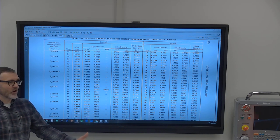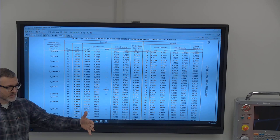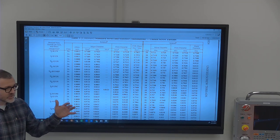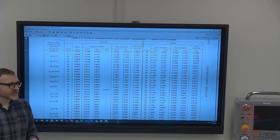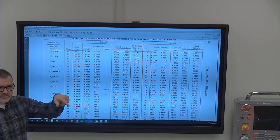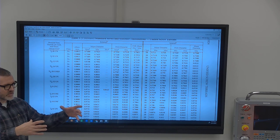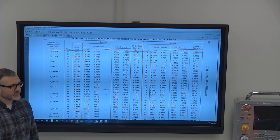Yeah. So we had some parts that we made all the time, and the outside of them was 22.5 plus or minus 1. I've told the story 1,000 times. So I was over at the customer one day, and we had made these for years. Hardened D2, interrupted cut, takes hours to just turn one of these diameters this long. I'm watching the die run, and I was like, how do you locate that? They're like, oh, we don't locate that. It just sits out in space, and we bring the punch down over it, center it up through it, and then tighten it down, pull it out, and then put the windows and stuff into it.